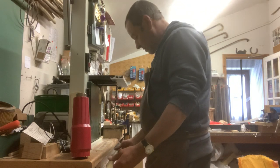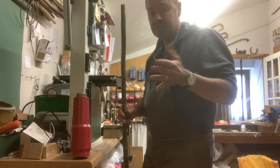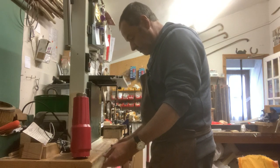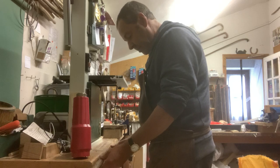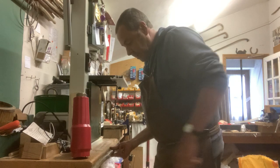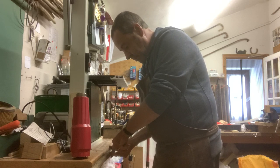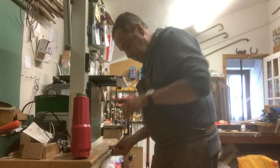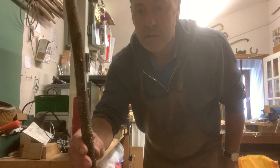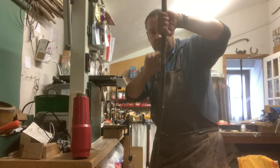I like to use a straight edge. The bench works really well. You can use your door frame on your shed, anything that's got a straight edge that you know is straight. Put it on here and I roll it about a bit until I find the biggest bend. You probably can't see from there, but here's my biggest bend. You follow that bend back to where it touches the table — and it's right there. So I'm going to mark that with a bit of chalk.